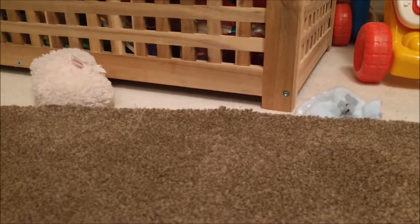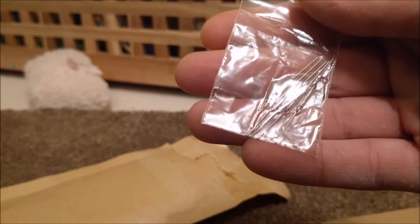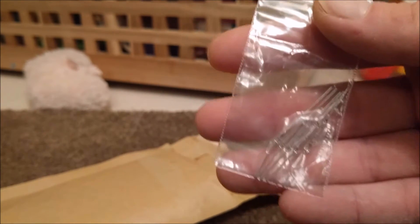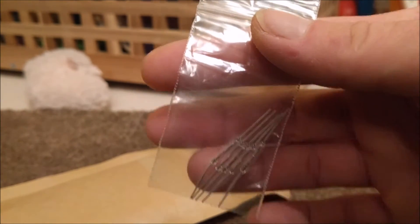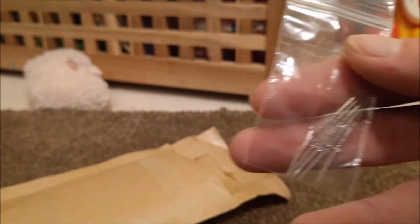The postman delivered what we need today. In this envelope I have two things — I only need one but could only buy five. These are called magnetic switches. There's a magnet in the airflow, and when it moves it closes these contacts to put the bag full light on. I broke it because it's made of glass, which is why it's on — it's basically shorted.